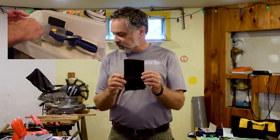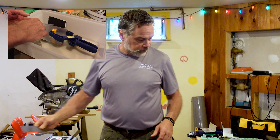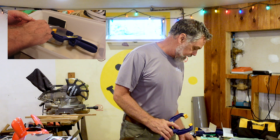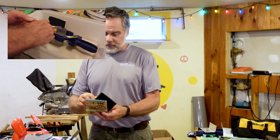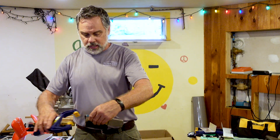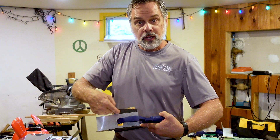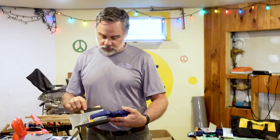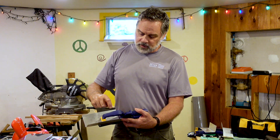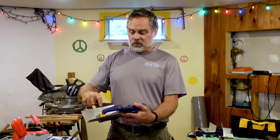What I did was submit each material to the exact same test: we pin it to a piece of OSB, then take sheet metal flashing and create constant contact, then put moisture along the top edge so that water goes down between the constant contact of the metal representing the metal roof.